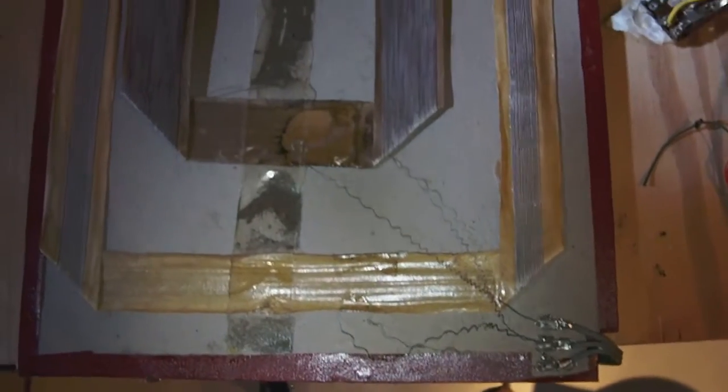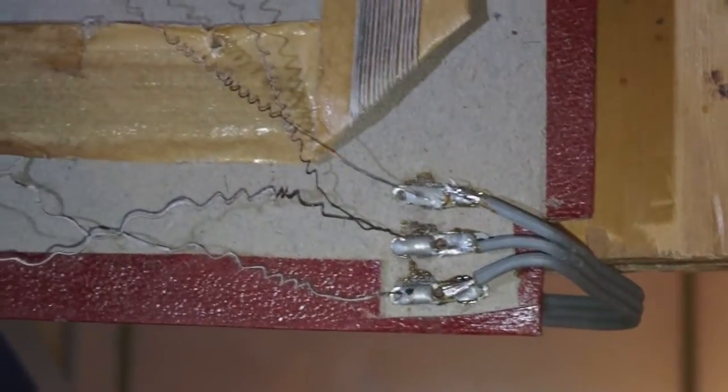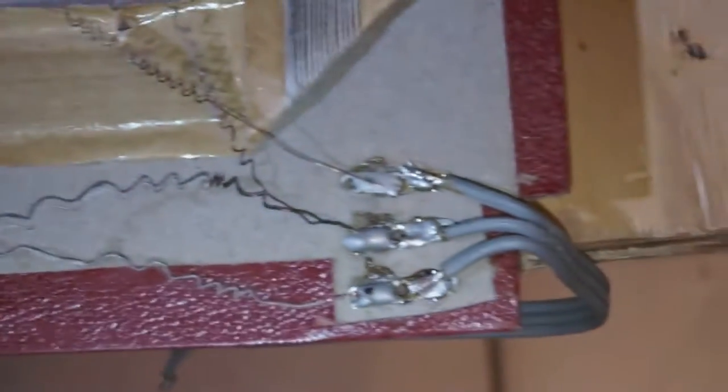So there you are, that's the chassis. Right, now at the back of the top cover there is a double coil antenna. I suppose one is for medium wave, the other is for long wave. Now they are attached to a wire, a 3-lead wire, as you can see. But really, the little wires that attach the coils are so tiny, so brittle, they are really thin. So I'll have to be careful not to break them. So there you are.